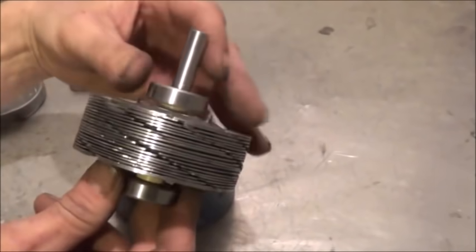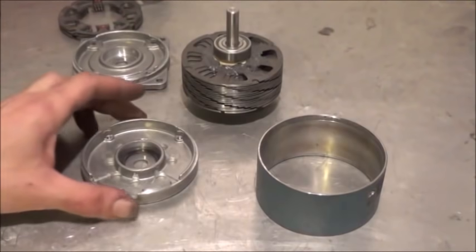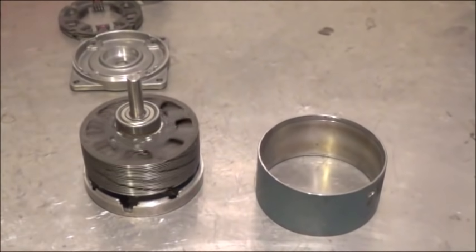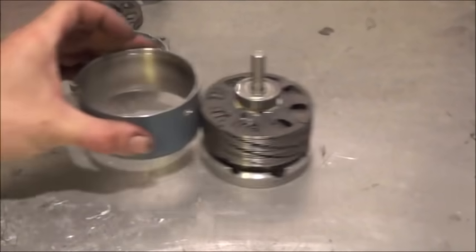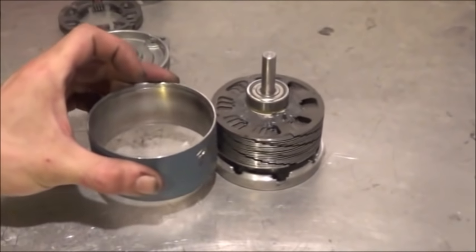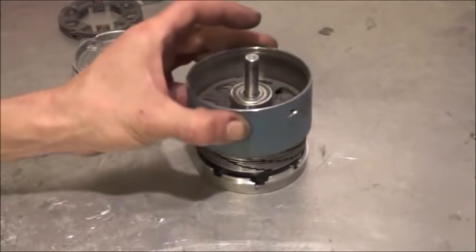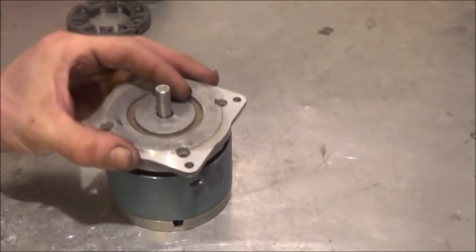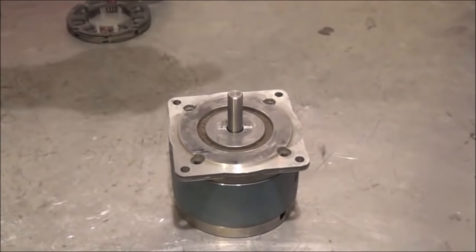I've honed out the outer ring. I put this in a drill and just used a grinder pad against it as I spun it to get that all nice and even — you can see how shiny it is. Let's go ahead and set this thing together now. I'm going to take the bottom plate, take the bearing cup, stick it right in there. Now that outer ring is magnetized, so if you just try to stick this ring on there and spin it, it's not going to look like it's spinning right. You've got to put the cap on to make sure you've got your tolerances — but that's going to give a really unique effect later on when we want to use this for other projects. So let's put that outer case down around it, take the top and put it on there, and now we've got a spinning Tesla turbine ready to go.